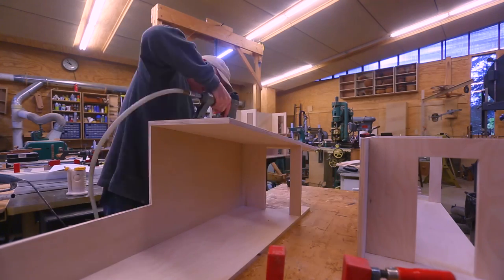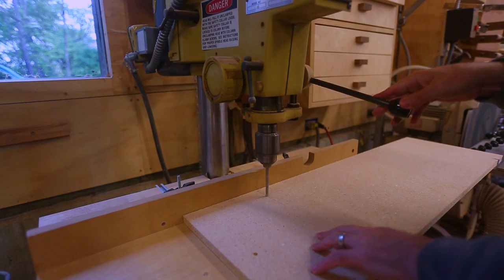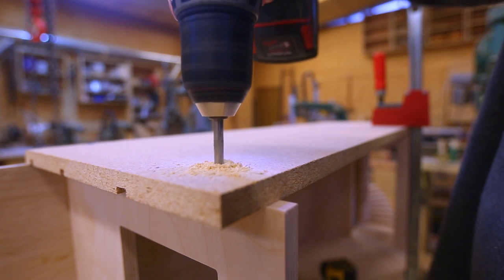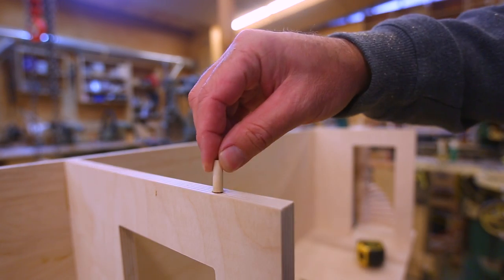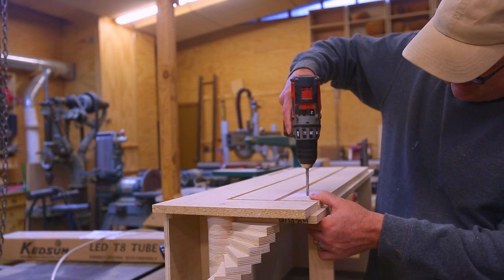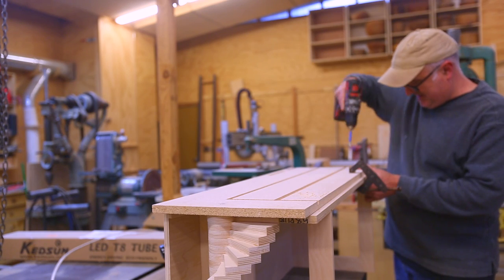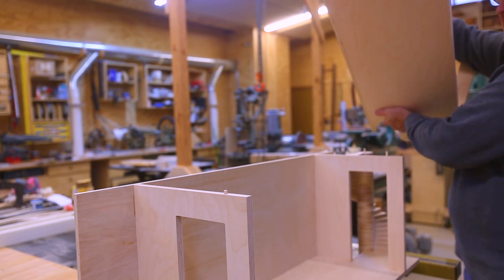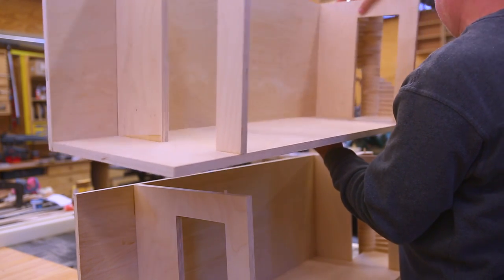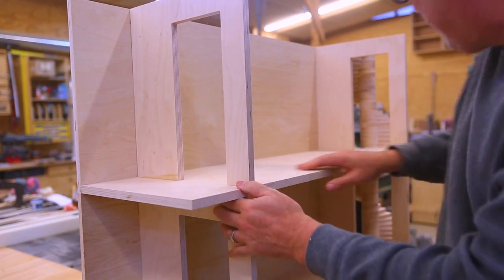I put the roof in place. Now I needed to stack the floors together and have them not slide out of place or fall apart. So I made a story stick for drill holes. I could use the dowel at the top of the stair as my reference point, then drill two holes into the top of each of the short walls. This let me drill the two holes in the bottom of the next floor in exactly the same place, so I could put pins into all three of those holes and have the floors fit onto those pins and hold themselves together.